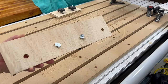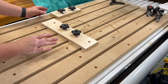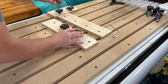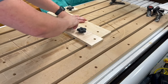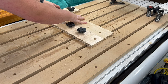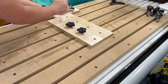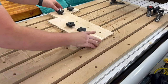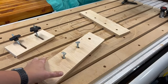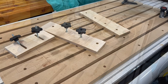Now it's time to clamp the boards down. There are plenty of options — these are quick DIY options that run along the t-slots on the CNC, going in the front and the side. You just have to make sure the board is secure; that's the most important thing. With juice grooves you'll have a big issue if it's not super secure. This solution uses cheap hardware and scrap plywood.